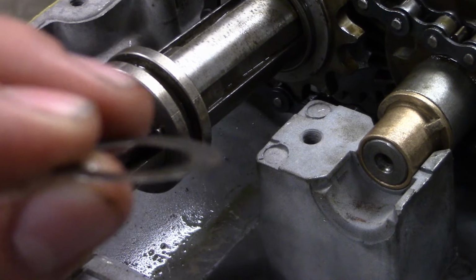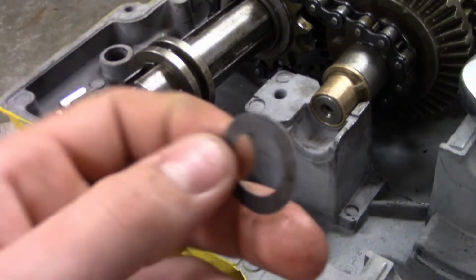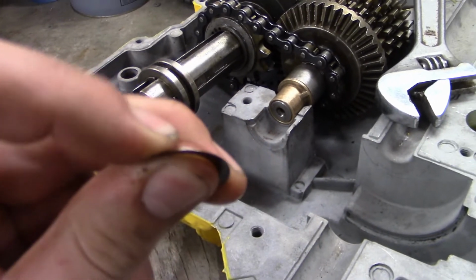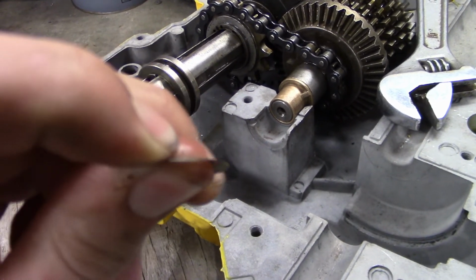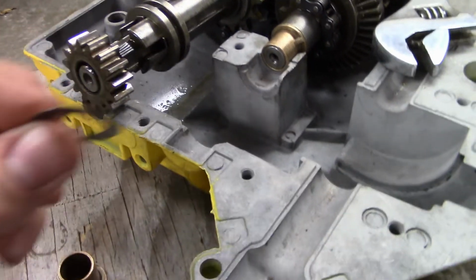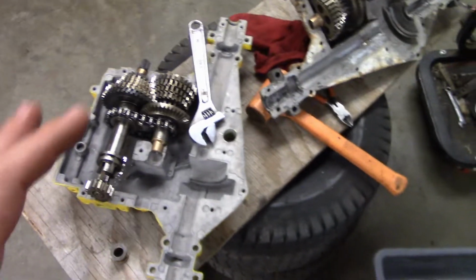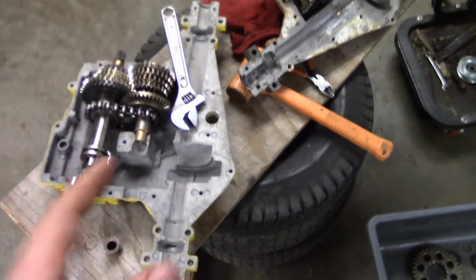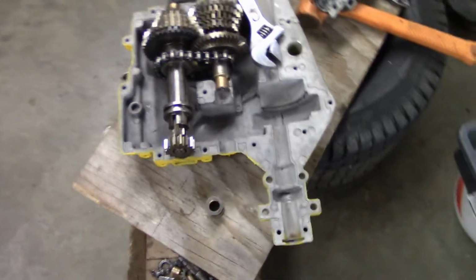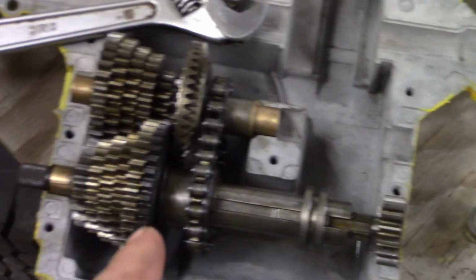It's a little bit tricky to see. I mean, that thing's small. Here, I'll show you. See, I'm bending that in my hand. You can bend it so easily, which makes it a super useful washer, which is probably the only useful part in a Spicer transaxle, the washers and the bushings, I guess. But that's how I got all of this end play correct. So I'll put that back together really quick, and then I'll show you what I've got done.